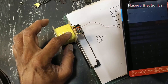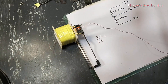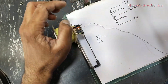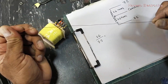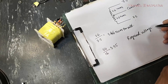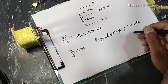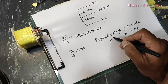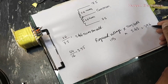I will not use the thick wire gauge. I will use the same wire that is used for the 16-volt winding, because it is enough for the current required. We will use 3.45 multiplied by 115, so 396 turns.